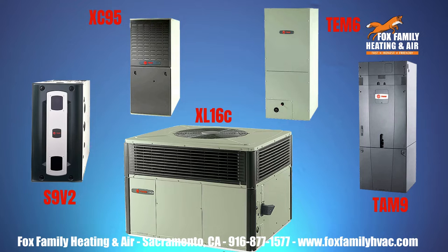The premium units with variable speed motors, and not ECM motors, are the S9V2, the XC95 gas furnaces, the XL16C package units, and the TAM9, TEM6, and TEM8 air handlers.